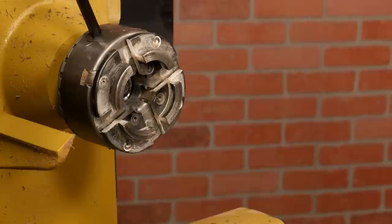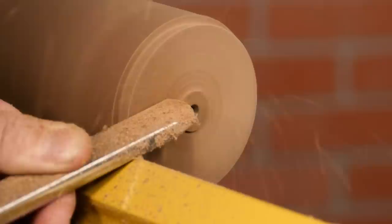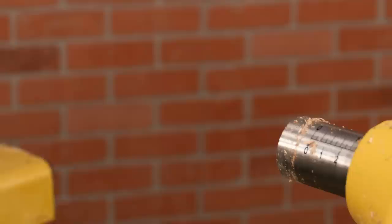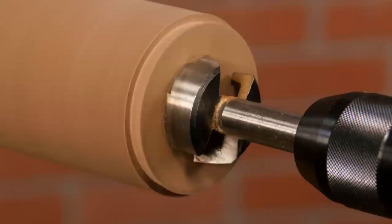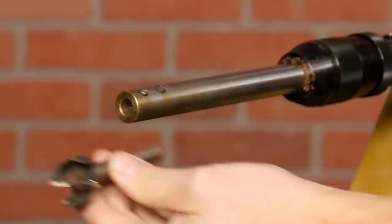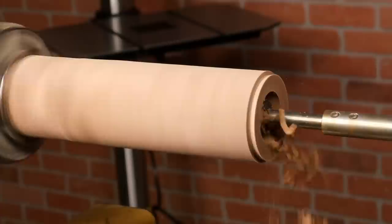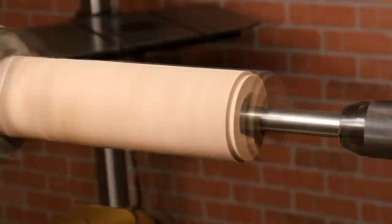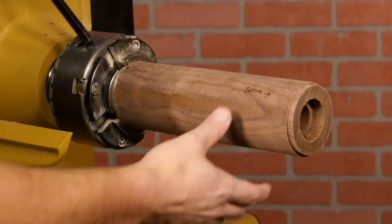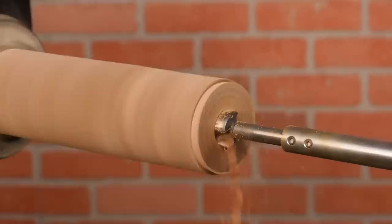Now we're ready to drill. This part of the process is tedious, but it's important to be precise. Start by mounting the top end of the mill body in a chuck, then square the bottom of the blank. I like to drill on the lathe using a drill chuck to hold the bit and the tailstock. Now drill a 1-5/8 inch diameter hole a half inch deep. Mount a 1-1/16 inch Forstner bit in a drill bit extender and drill a hole halfway through the mill body — don't worry about drilling exactly halfway, just get close. Remove the mill body and turn it around, securing the bottom in the chuck. Finish drilling the 1-1/16 inch hole from this end until you've drilled a hole all the way through.